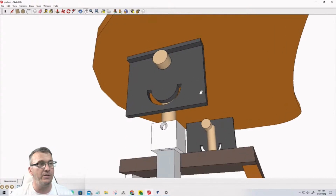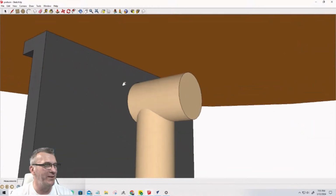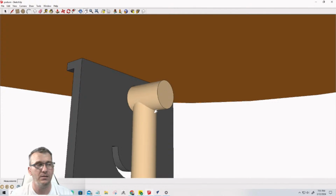We're going to make them out of 3/4 inch material, 5 inch by 5 inch, and we'll lay everything out in Vectric in just a moment. Ignore that my bracket is kind of out of whack over there. This one is correct over here. We're going to be using 1-inch dowel stock and 7/8 inch dowel stock. So we're going to need two 36-inch by 7/8 inch dowels from Lowe's, and then one 1-inch diameter dowel, where we only need 2 pieces that are about 4 or 5 inches.